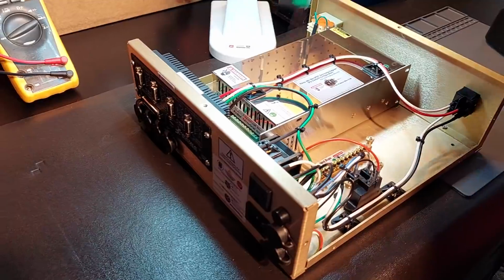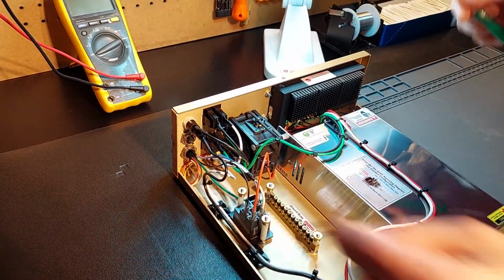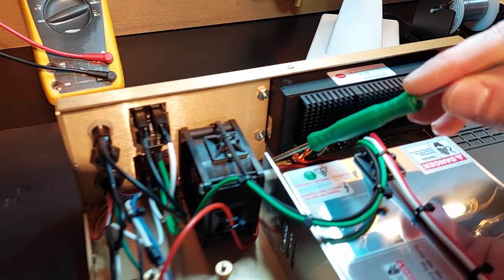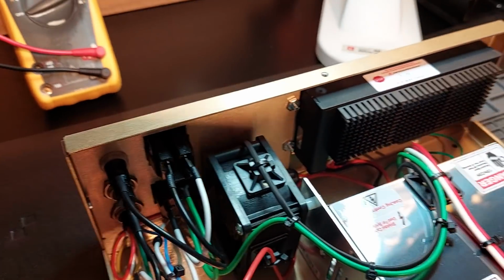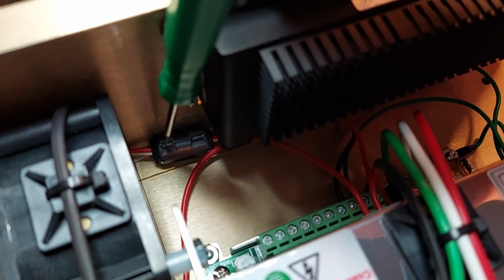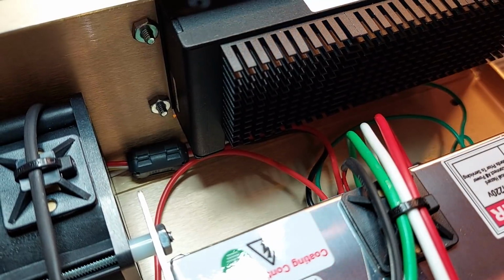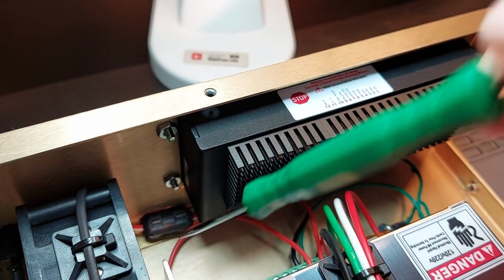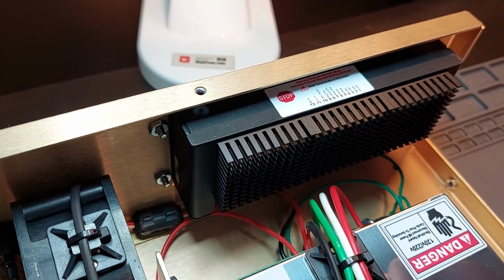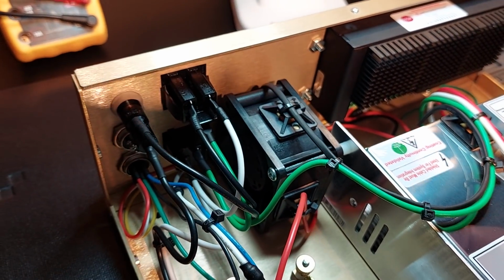Okay, so again, finishing the system, we have a TDK ferrite installed internally. You can maybe see it. Let's see. Come in right here. And you can see that ferrite right there installed going over the GX16 leads, which once again enter into the G540 filtering all of those connections as they're going in for any signal manipulation going to the VFD.